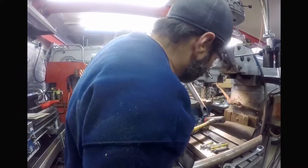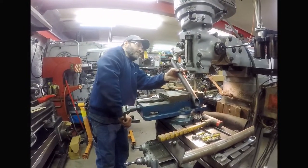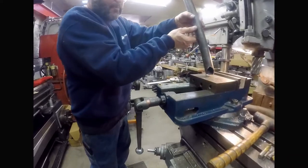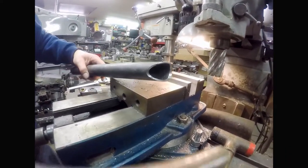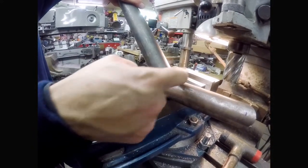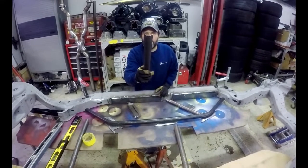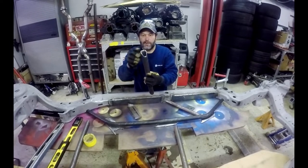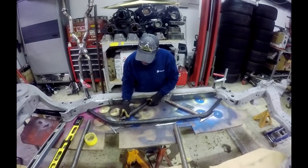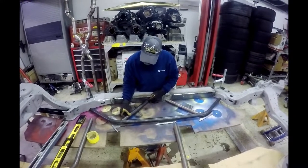Cut that made. Nice straight cut. Now, see, that should fit right around it like that. And now we got a nice, sweet! She fits like a glove. Do the cope like that. Nice cope, and it's got a little toenail right here that copes all the way around that as well. That's at our 45 degree angle, so that will fit against our wall right here, and boom, there we go, got a nice little fitment right there.